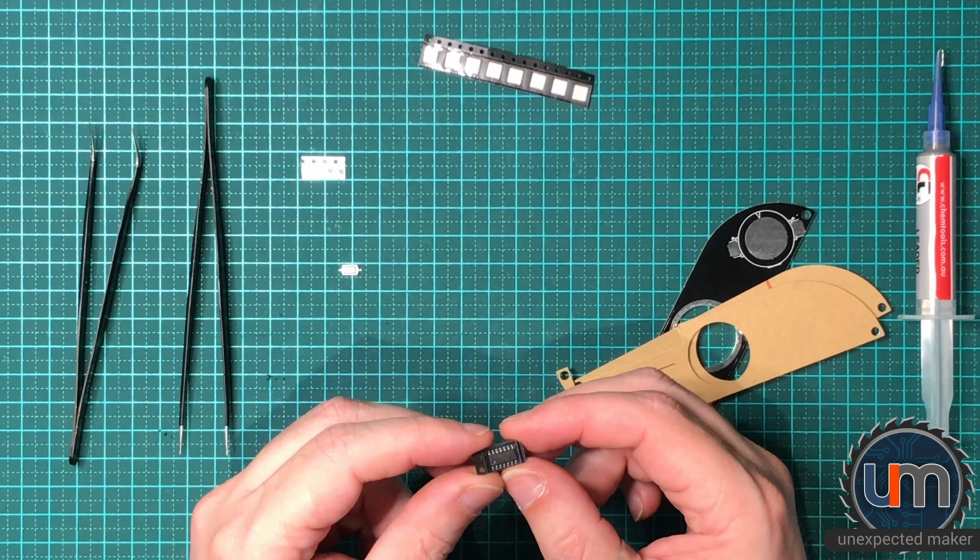Okay, let's get going. I didn't want this to be a long soldering session. I'm going to again do this with my solder paste, and I'm going to do it without a magnifying glass. So hopefully I won't make too much of a mess. I've had the solder paste out of the fridge overnight in anticipation of this, because you need to store it cool, so a fridge. But you need to let it warm back up to room temperature to use it. Otherwise, it's super hard to get the solder paste out. And we need to make sure that we clean the end of it before we start. So I've just got a cotton bud that I use for that.